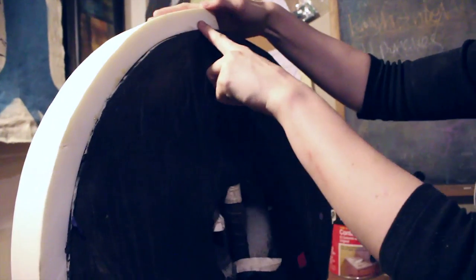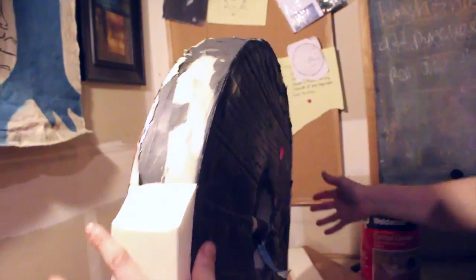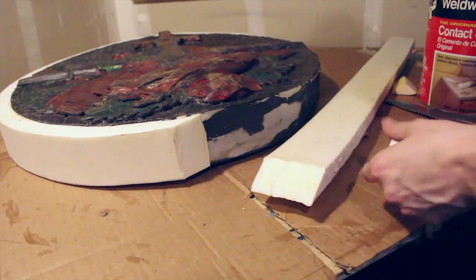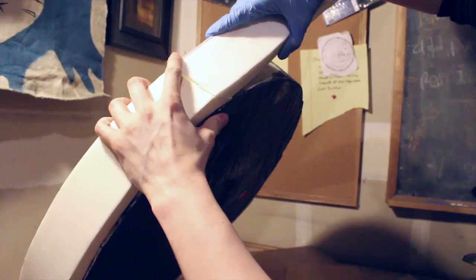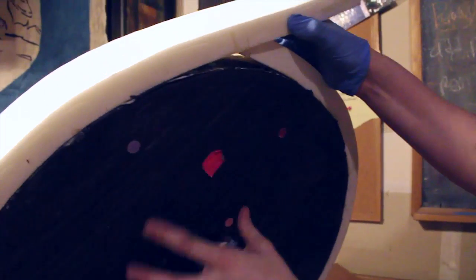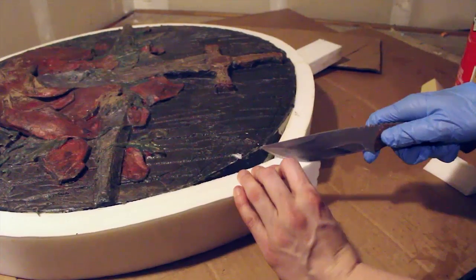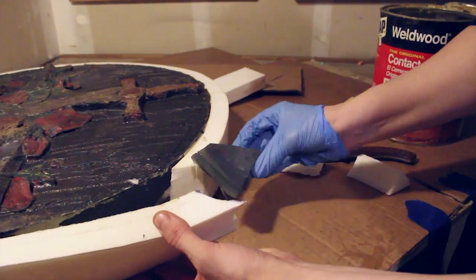Match that angle to your other extra piece of foam, because most shields take two pieces of edge foam. It is two-pound polyethylene cross-linked foam — if you want to order it on your own, that's what to look for. At the very end, match your angles — give a little extra room so you can trim it smaller, since it's easier to cut off than to add or patch.